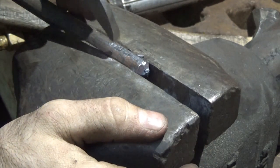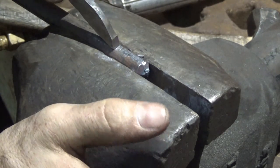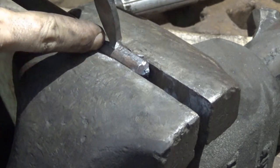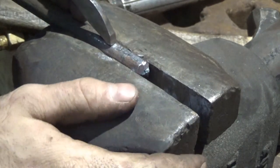The three things you want to keep track of are: first, this angle — the angle of the bite of the chisel. Angled like this, you're going to cut deeper into the metal and you'll probably get stopped, needing more force to move forward. Angled like this the other way, you're going to take a lighter chip but you might pop the chip out of the cut. So you need to keep that in mind.